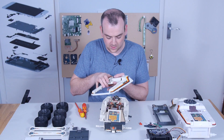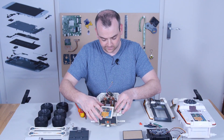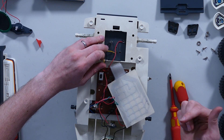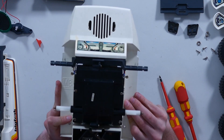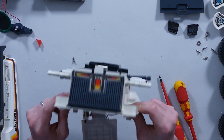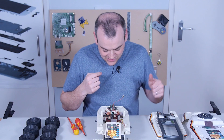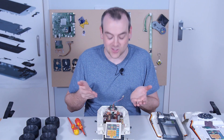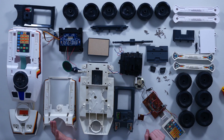Any accessory needs batteries with the new model. With the lock ring off, now we can see the important bits. Rather than just having nine volts and six volts from the D-cells, they've actually got multiple tappings — I think it's supplying three volts, six volts, and nine volts. Interesting. You've got the same ribbon cable as on the modern equivalent, and the same keypad layout. It'll be interesting to find out if you could replace an old one with a new one. The last thing is to remove the old PCB, and there we have everything inside a 1979 Big Track and a 2010 Big Track.